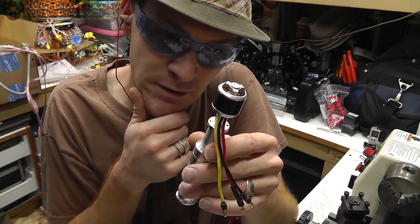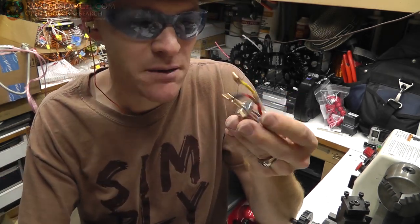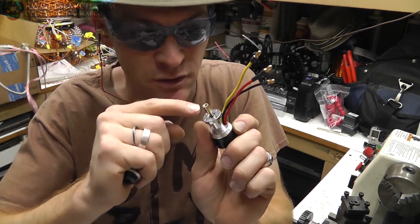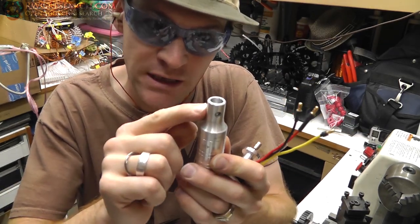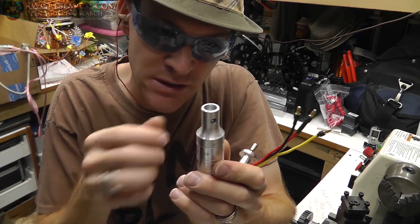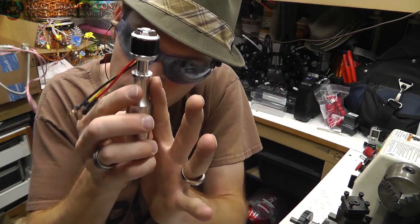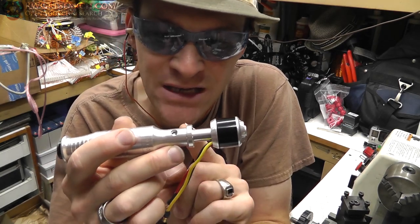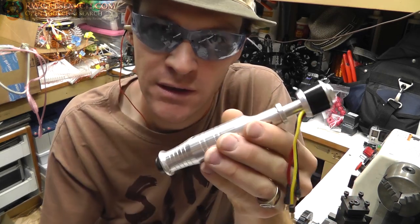The best solution I came up with is we make a plate that fits on here that has the holes in the right spot and can fit over just this coupling. We attach it here with recessed screws so they're beyond the end of the plate. Then we make an adapter that fits on the outside with a flat plate that we put holes in. When we put the two together we can just bolt the plates together from the bottom side. And if I made everything fit inside each other with a little lip, everything should be centered perfectly. These are machined parts so everything should fit perfectly if I do my job.